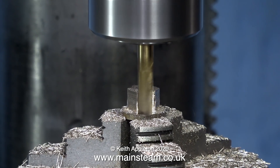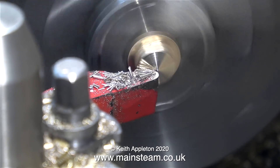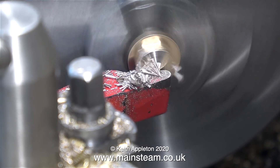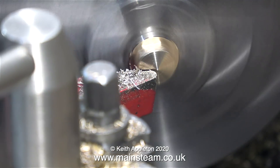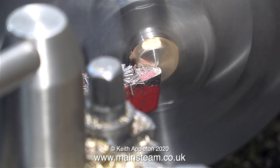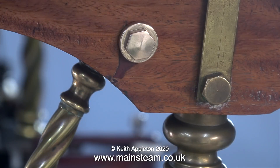Well, almost — I needed to clean up the flats on the bolt. Then it's back over to the lathe and I'm finishing off the bolt using a round nose cutting tool. I've changed the position of the tool holder to get a nice domed effect. This is a very decorative bolt so it has a sort of inbuilt washer, and here I'm turning this part to the final size and removing the sharp edge. From now on the job is a matter of personal taste. That's the machining finished — the rest is handwork, just cleaning up the part, and now it looks like this. Not a difficult job at all once you know how to do it.